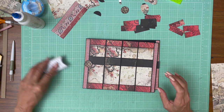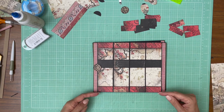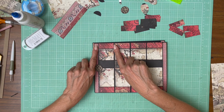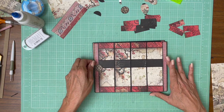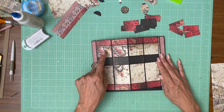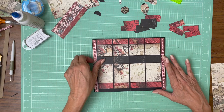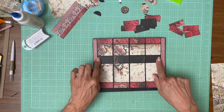Make sure you're patient because it's going to take a little time, but there are a few things that are pretty standard. The red strip on the top and the bottom are both 3/4 inches tall and 1 7/8 inch wide. And you'll need 4 of those to go across what I've turned into 4 sections, but what are really 2 sections. So if this feels too complicated to you, you could have just done one here, one here, one here, and one here. But I thought it looked more like a Japanese screen if I added it into these smaller segments. So that's the thought process there. 3/4 of an inch, 3/4 of an inch, 1 inch.